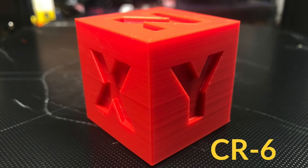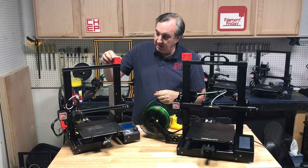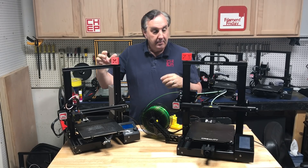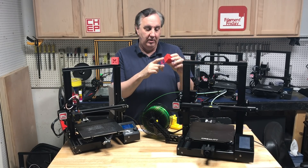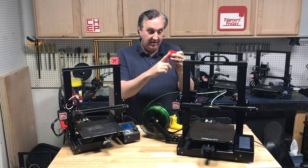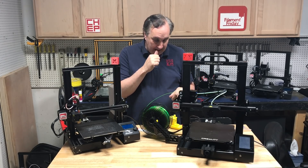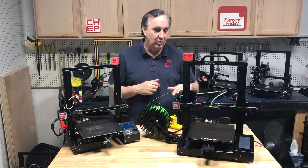This was at my 0.12mm profile. The Ender 3 with the same settings is slightly better because there's no glass bed so there's no ringing whatsoever, but the CR6 SE result is really good. I did get some warping though, so the Z offset still wasn't quite right, and I cleaned the bed because I was worried about adhesion.